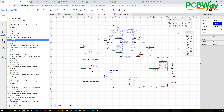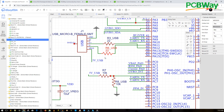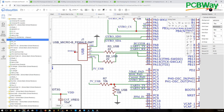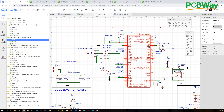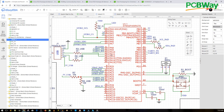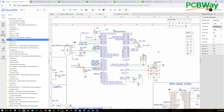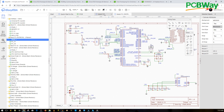That output goes to a 3.3V regulator which powers the microcontroller unit. It's very simple — one step at a time and you'll start understanding it, especially once my series goes deeper into designing and manufacturing your own PCB. So all we did was solder to the 22-ohm resistors, give 5V to the Schottky diode, and connect ground anywhere — that's it. As you can tell, it connects on pins 44 and 45 on the flight controller. Once you understand this, you can figure out just about anything wrong with a flight controller.